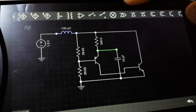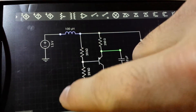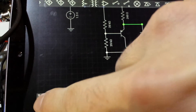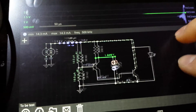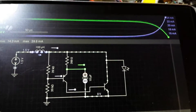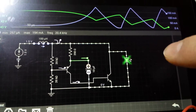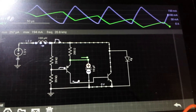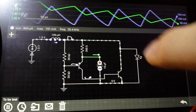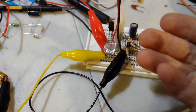You can actually change and modify the circuit — let's put an LED in here. And I'll actually see the simulation here; in real world it would actually work exactly the same. It will drive the LED a little bit more than 20 milliamps. But as you can see it actually works as a little voltage booster. The only downfall I found is it doesn't work at very low voltage — you drop to about 1.2 volts and the circuit will stop working. But besides that, for various uses like higher voltage and transformer, or a little low-cost inverter and stuff like that, it actually works very well.